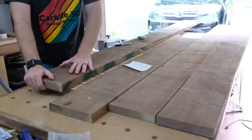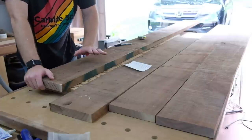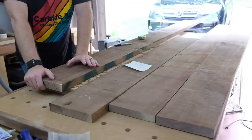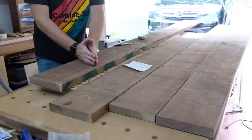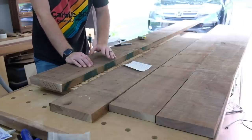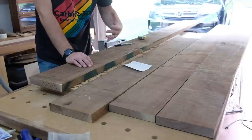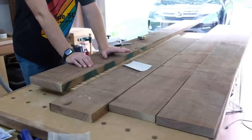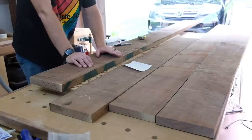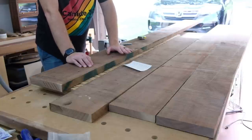Now this is five quarter material, which is an inch and a quarter thick in the rough — it might be a little heavier than that right now. I need five eighths inch thick material for the case, and then my dividers need to be three eighths. In my world, that's a little close as far as resawing, jointing, and planing to get that finished thickness. I'm not sure if I'm going to be able to do that, especially with walnut — with how much it cups when you resaw it. This is quarter sawn, so it might not cup as much, but I'll try one piece at the bandsaw and see where that leads me. It would be really great if I had eight quarter material because you have more to work with, but these five quarter boards were the best looking as far as color and grain were concerned, so I chose these instead.